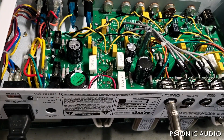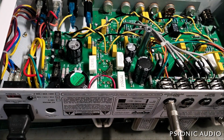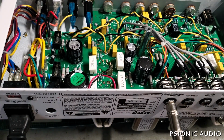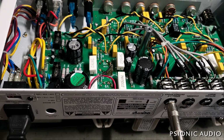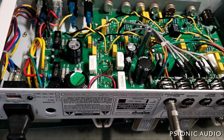And I'm going to check whether this cathode bias is actually cathode biasing each output section. An EL84 is nominally a 12 watt tube. And when it's cathode biased, you really want to be about 100 to 115% idle dissipation. So roughly 12 to 14 watts is the desired range. Hotter than 14 watts, the tubes die, as these have died. Lower than 12 watts, you begin to have a bit of graininess when you really push them up, because of oddities of cathode bias that I'm not going to get into, and how the gain actually works. Sorry to be a little bit distracted.